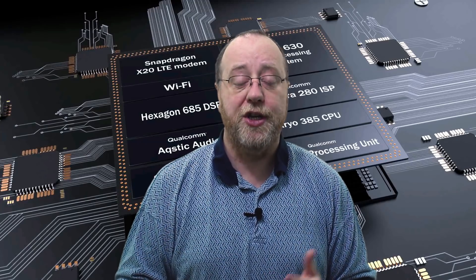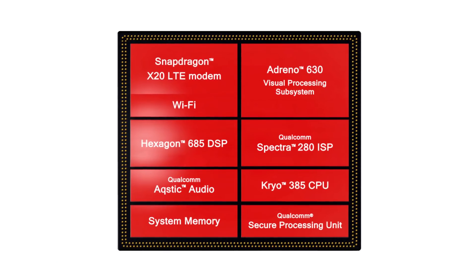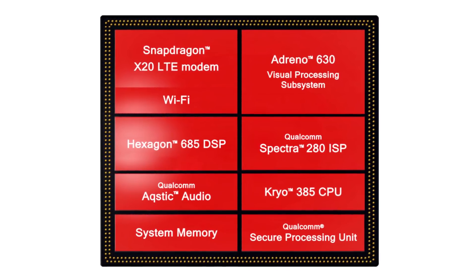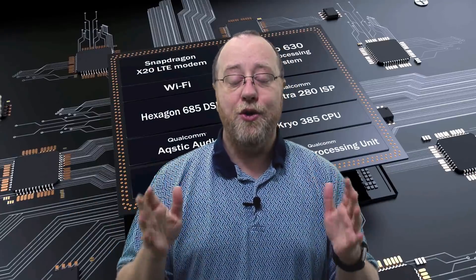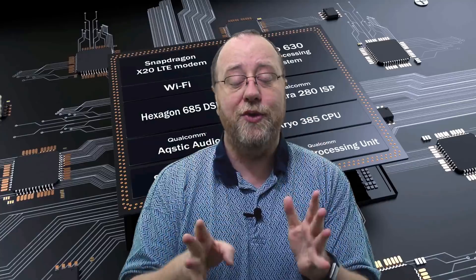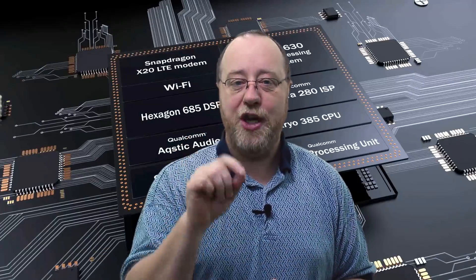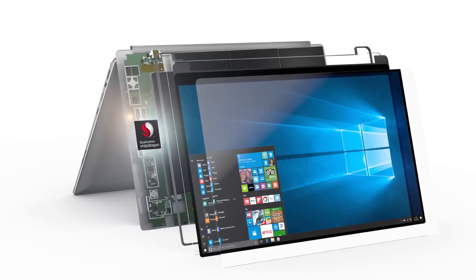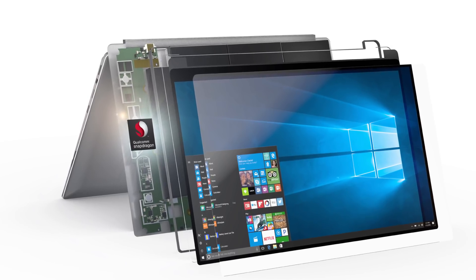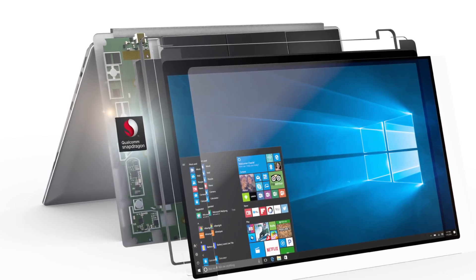Overall, I'm pretty impressed with what the Snapdragon 845 is offering in terms of specifications. You've got the latest CPU using DynamIQ from ARM, the latest GPU from Qualcomm themselves, and on top of that the DSP, ISP, acoustic chip, audio processor, and security processor. You've got access to eight gigabytes of LPDDR4 RAM. It looks really, really impressive. Of course, we won't know how impressive it truly is until we see phones launched next year. Qualcomm made it very clear that this chip is optimized for Android and for Windows running on ARM — and following this year's laptops running Windows on the Snapdragon 835, next year we're absolutely going to see laptops running Windows on the Snapdragon 845.